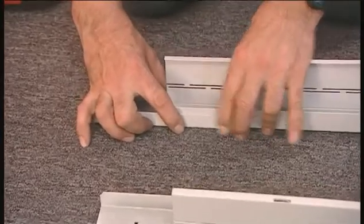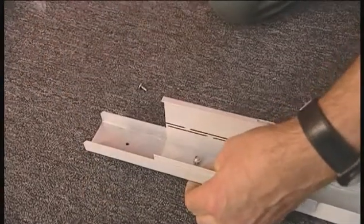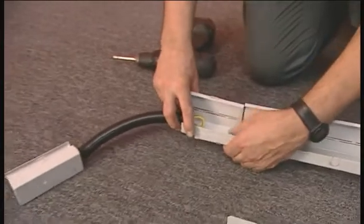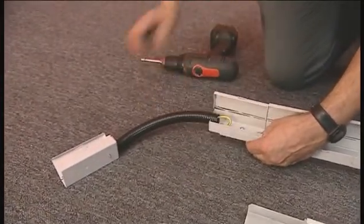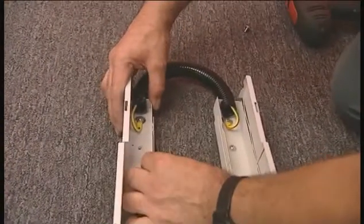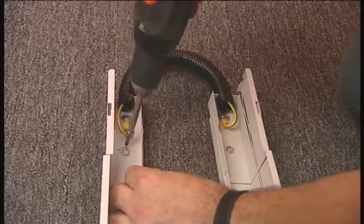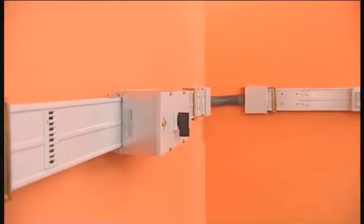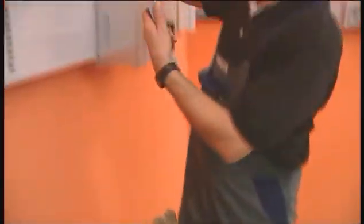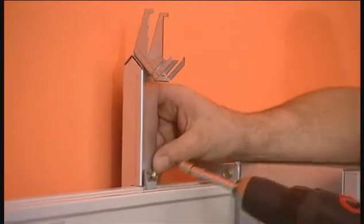For the separate installation of data lines, an ancillary bus duct equipment is available. The following sequence shows the installation of a connector. A flexible junction unit that permits any change of direction is connected to the bus duct. The bus duct is installed with fixing brackets, which are attached directly to the bus bar trunking system. This method also permits easy upgrading and patching of existing systems.